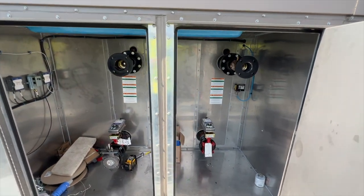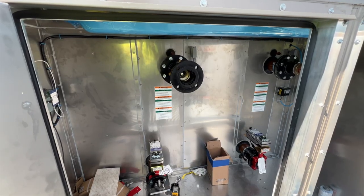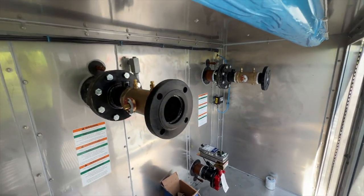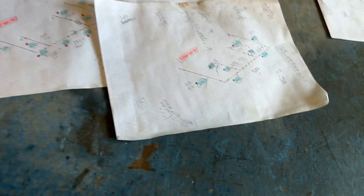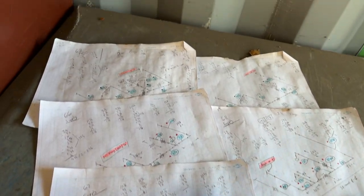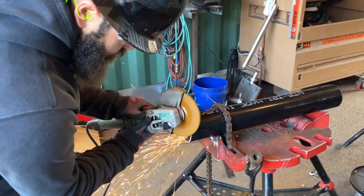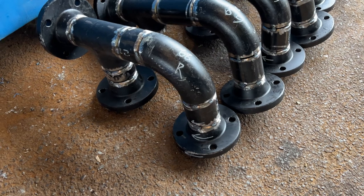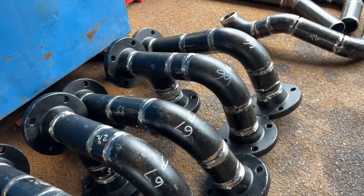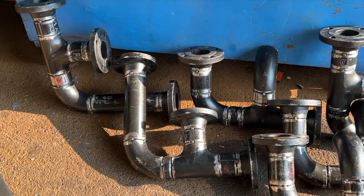Now that the circuit setters and control valves are bolted onto the flanges screwed onto the 4-inch threaded connections, I can start the rest of the piping down through the cabinet floor. After a day of measuring, sketching, and doing math, I have six separate ISO sketches — one for supply and return on all three units. If you're interested in more details on the pipe fitting side of this, let me know in the comments. After running the Ellis saw, beveling, and end grinding for what seemed like days, Corey and I were finally ready to tack everything together. Between the three units, there are roughly 18 3-inch welds just inside the cabinets.